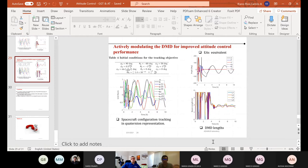That is essentially because, as you are saying, these maneuvers using environmental torques require a lot of time to be done, and they are just intended to compensate for small deviations and small angular velocities. In the case that we showed in that paper, we didn't hit the first mode of vibration. We were well below that. But if you are coming up with different configurations and attempting faster maneuvers, then you will need to take into account the flexible dynamics for sure. Okay, perfect. Thank you so much. It was very, very interesting.